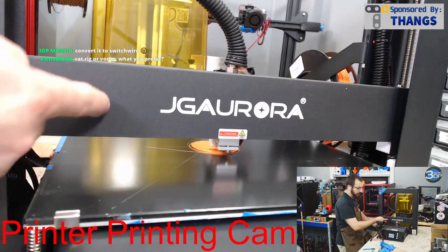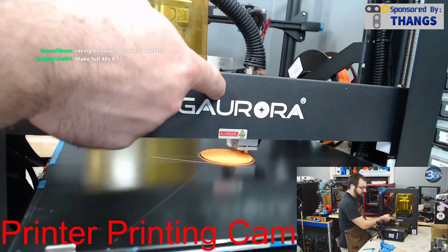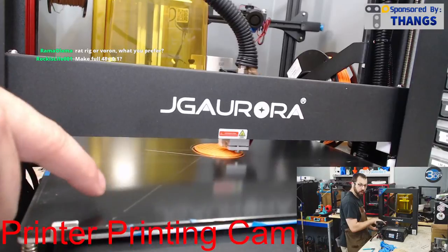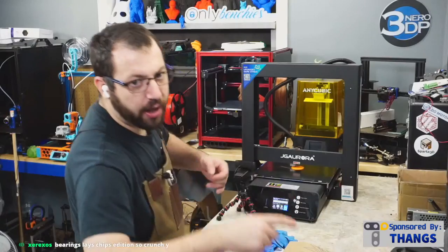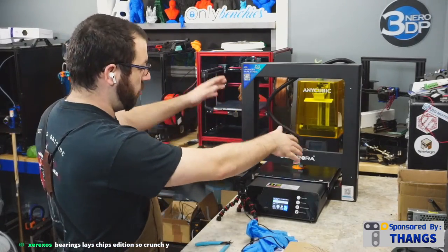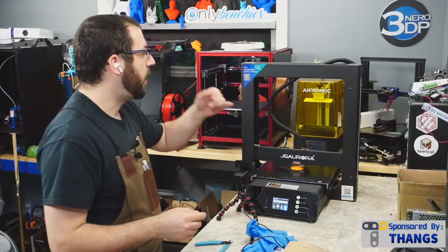This cover plate comes off. Mount an inductive probe to this side of the carriage. Bed flex plate, go with a spring steel flex plate. And install Klipper. So with that, you have Klipper. You can do the gantry tilt to de-rack this mess. You got your flex plate, spring steel. You got a better extruder.